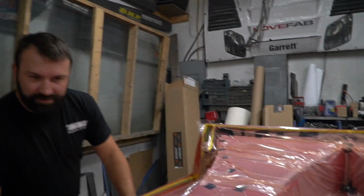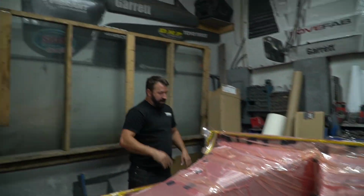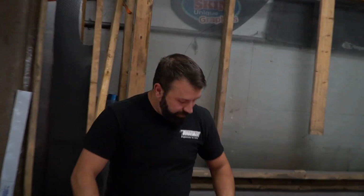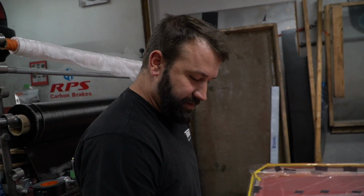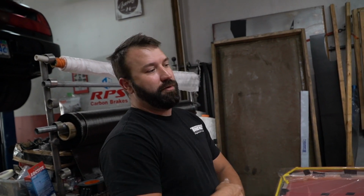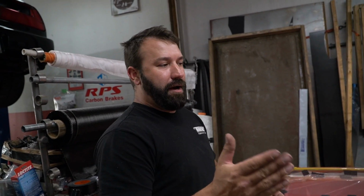Did you get it all sucked down yet? I was thinking so. Oh, well, it's all sucked down. I would say so, yes. So we chased it all down. It's not a perfect vacuum, but I think we have a cracked flange in the mold, so I'm not really going to sweat it. My goal is just to have the thing under vacuum. So I know you were really surprised when it hit 28 1/4. Yeah, so 28 3/4 on any part bigger than a simple thing is max that pump will do. And then we did a vacuum test, and it dropped about 1 pound in about 5 minutes, which I can't believe we got that good. So we're going to send it.